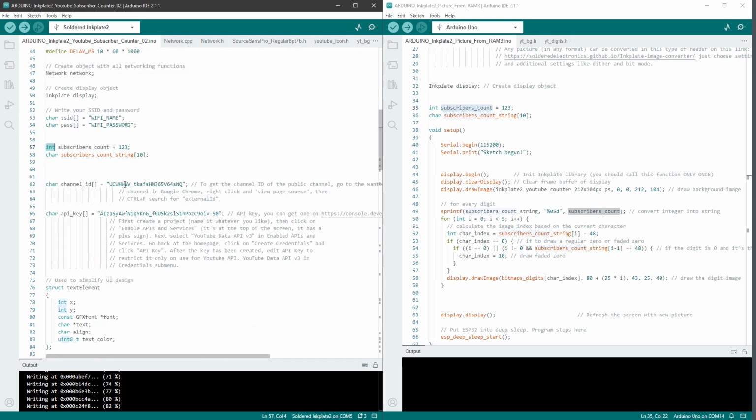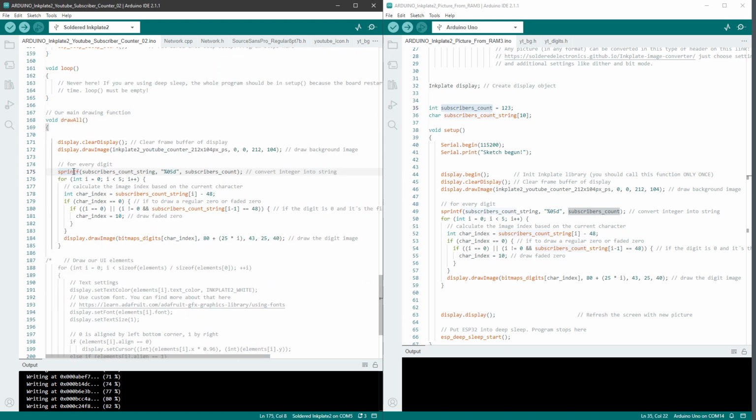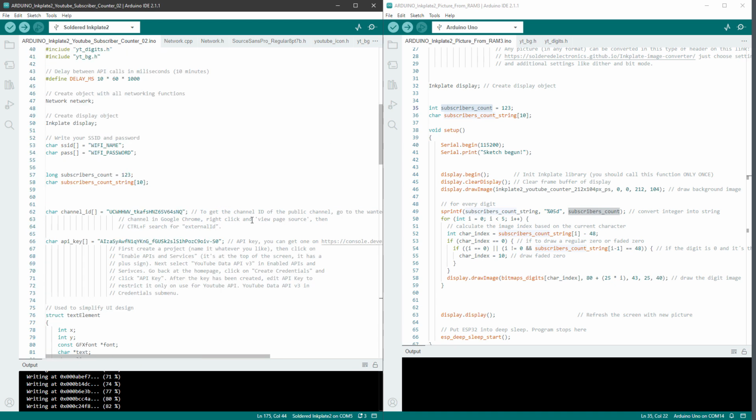I will change our subscribers count also to be type of long, and since we've made this change, we also have to update the sprintf function. Down here for the sprintf function, converting the integer into the string, we are now converting long into the string, so we have to type in LD instead, and that should be enough. Just give me a second to insert my real Wi-Fi name and Wi-Fi password and click the upload button.